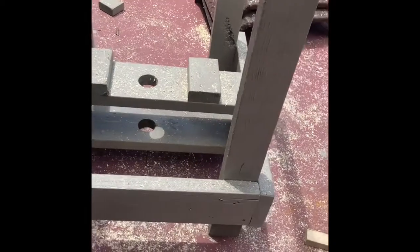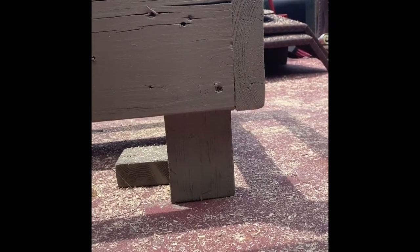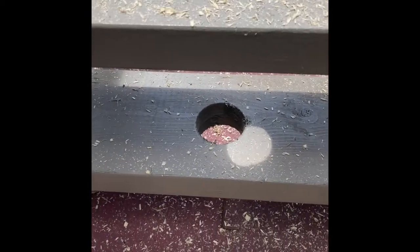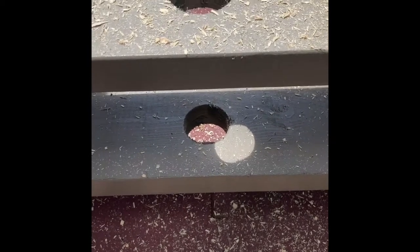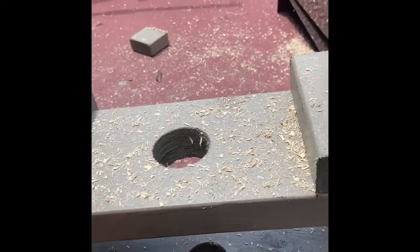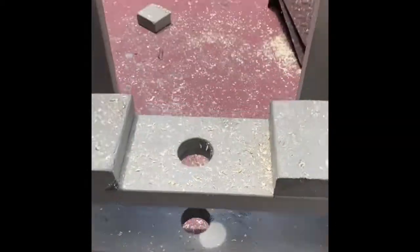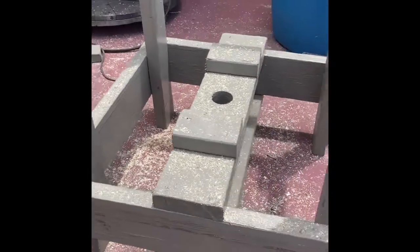I've got two-by-sixes on the bottom, up about five inches from the ground. Leave enough room for your pulley — that's the main thing about getting it up off the ground with your supports. The two supports inside will hold the pillow block bearings and the shaft. I have a one-inch shaft, but you could go down to five-eighths or three-quarter. The bearings sit in here; I'm orienting them this way so I have more room for the pulley underneath, close to the two-by-six.